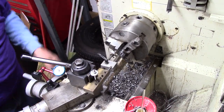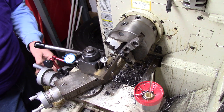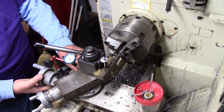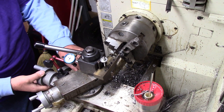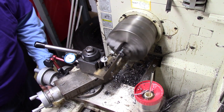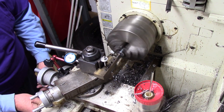This is loads of fun. I've still got some room to go — I'm at 579 and we want 625, so I'm going to go about thirty more thousandths. This is pretty tough to bore.